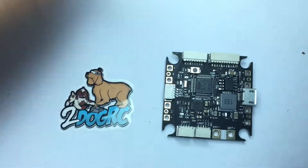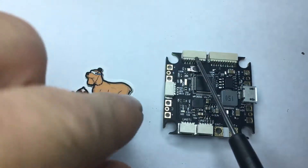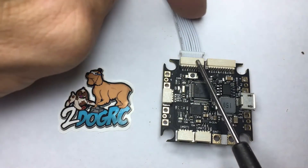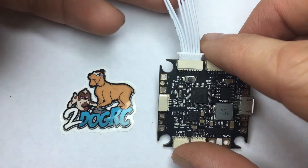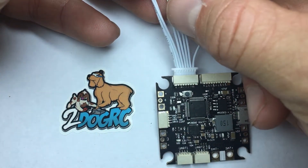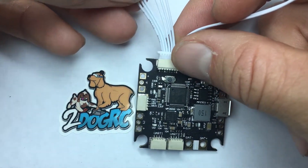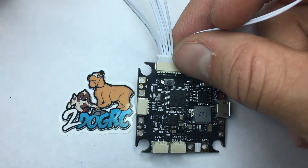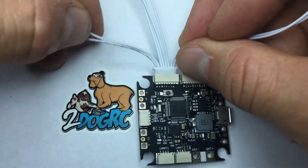On this big tab at the back, this is where you get a big wire going to your ESCs. You have a wiring harness with eight wires coming off of it, and the instructions have it pretty well labeled. So this is your ground, 5 volts, ground, 5 volts — which you probably aren't really going to need. Then you've got your four speed controller signal wires, which you will need. The LED wire is the last one, and the current sensor wire you won't need. Basically you only need a few of these wires off of the harness.